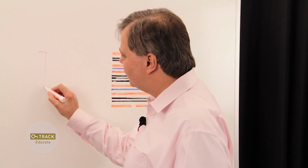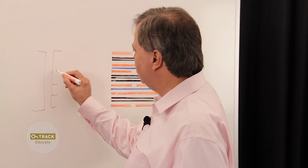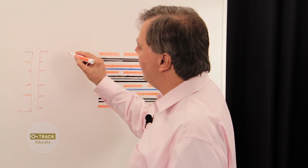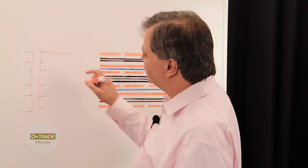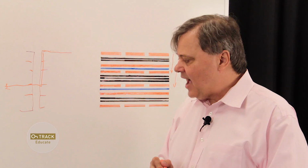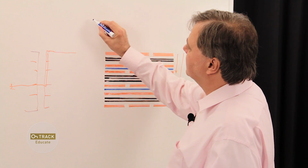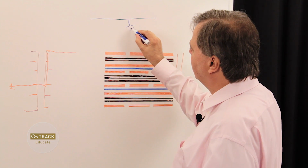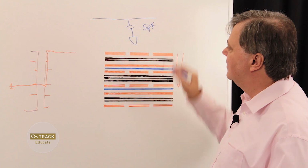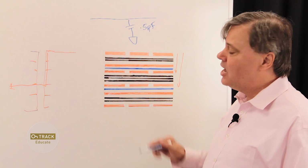Now, with your through-hole vias, those will go completely through the layer stack, and then we will bring out an annulus on each of our copper layers. Now, there's a problem with this, in that when we're routing from a top layer to our second signal layer, we have this via stub left over here. And the problem with that is that adds parasitic capacitance to our signal. So if we were to draw a single-ended signal here, we would have parasitic capacitance to our AC ground. Now this can be as much as a half a picofarad.